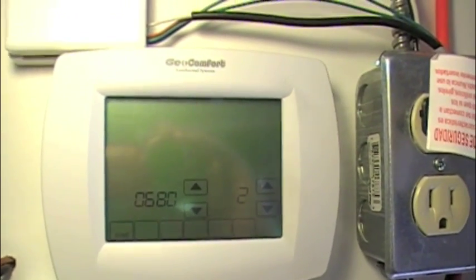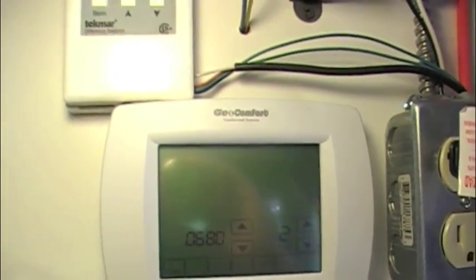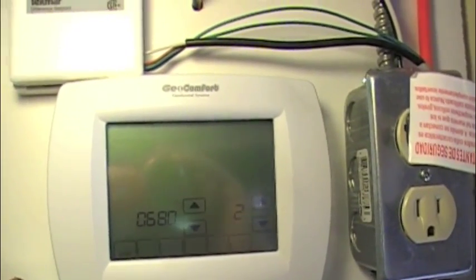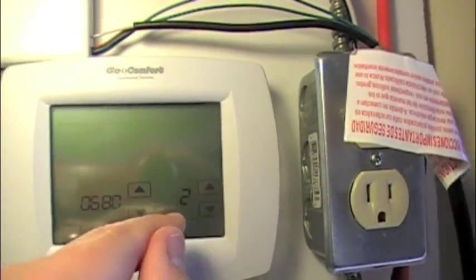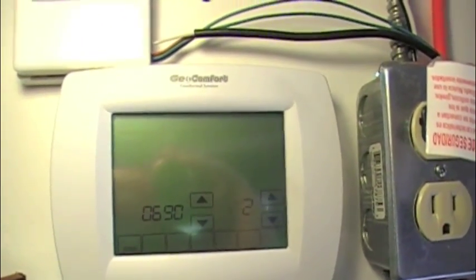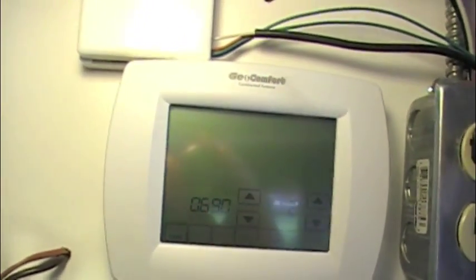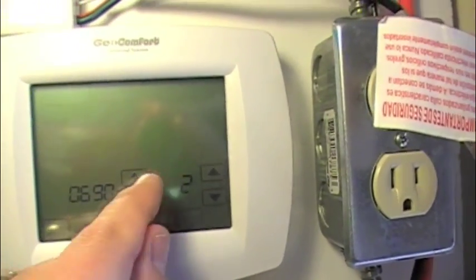Item 680 is heat temperature control. Two is standard temperature control, which is recommended. One is for if the room is warmer than the set temperature, and three is for if the room does not reach the set temperature. They do the same thing in cooling mode: two for standard, one if room is cooler than set, and three if room does not reach set temperature. I don't fully understand those options to be honest.